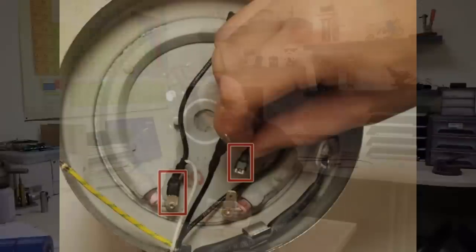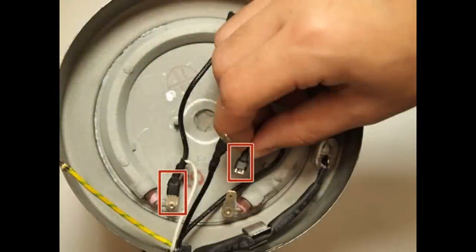It's the same with the kettle. You look at a kettle is rated at 3 kilowatts. It's plugged into a mains supply. The mains supply will supply 230 volts at 32 amps. You don't want it to go more than 32 amps or you'll flip your breaker.